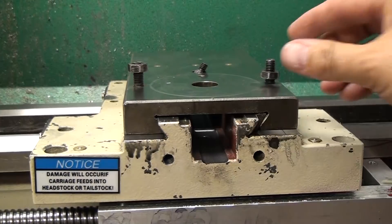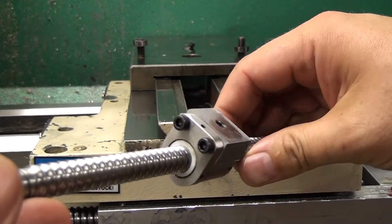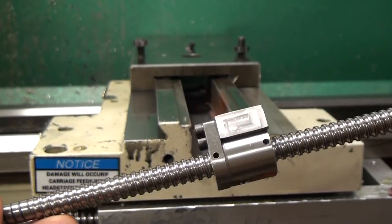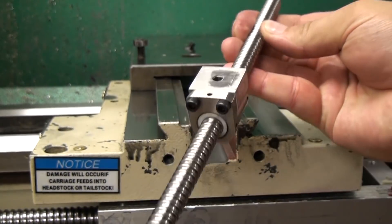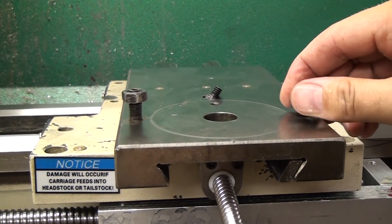The adapter basically mounts to the ball nut and then you screw that entire assembly to the cross slide. In that shot you can see that my ball nut has been totally modified — one flange has been machined down, the bottom flange totally removed, a flat machined on the bottom. You'll also notice that the saddle has got a slot machined out of it.